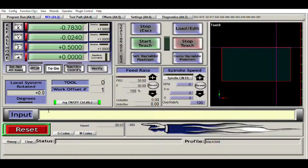However, things got complicated when I tried to cut an arc in a clockwise direction, then return the cutter counterclockwise to its original starting point using a G3 instruction. I will show you how I came up with a different way to automatically allow for cutter compensation later in this video.